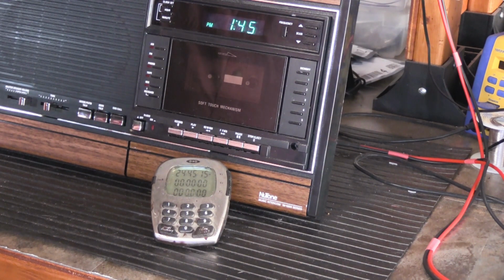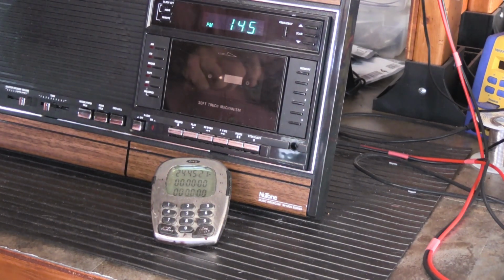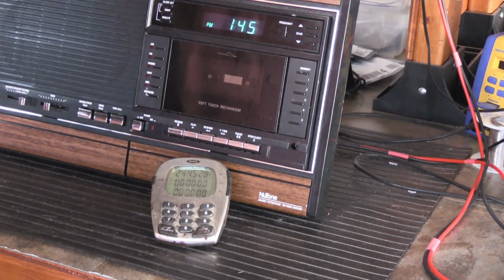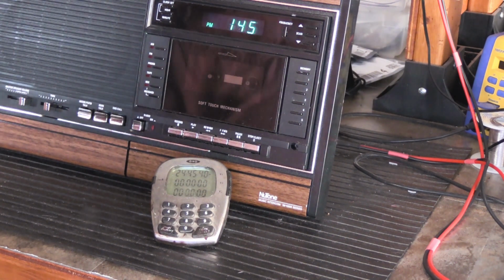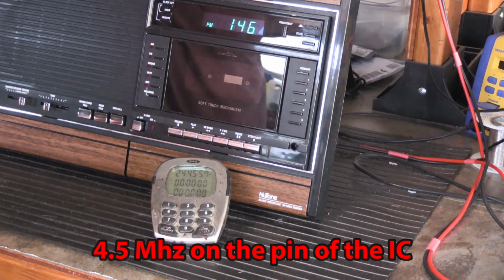So I set it back up, and in the service manual for the IM4006, there is a page that explains how you can adjust the timing signal for the clock. However, the information on that page apparently is incorrect, because in following it, it did not turn out the way it was supposed to according to the instructions. It says that you attach a very, very small value capacitor to one of the leads of the integrated circuit, and you're supposed to measure a certain frequency, which I think is 2.5 megahertz. I put the manual away. I should look. Hold on.